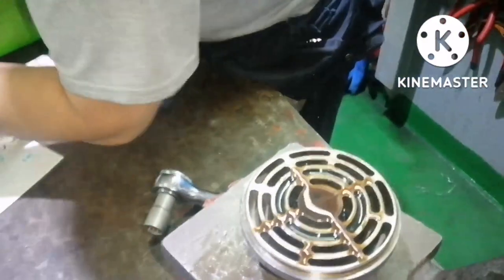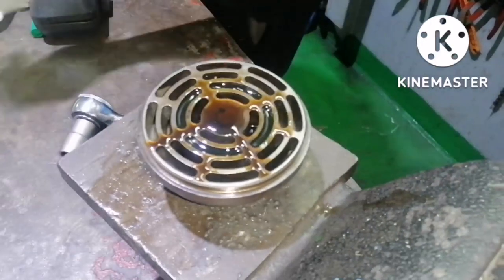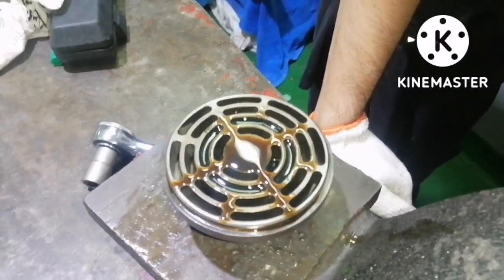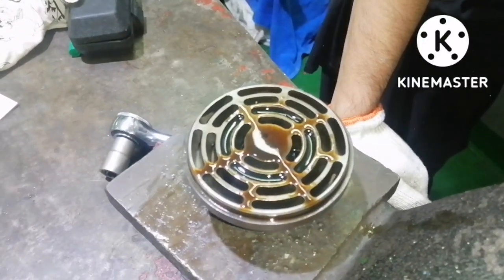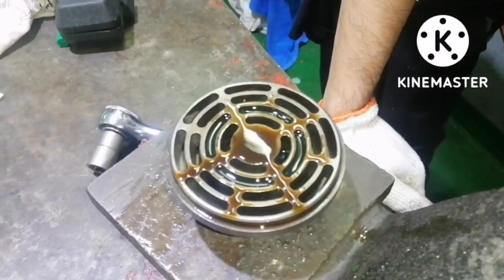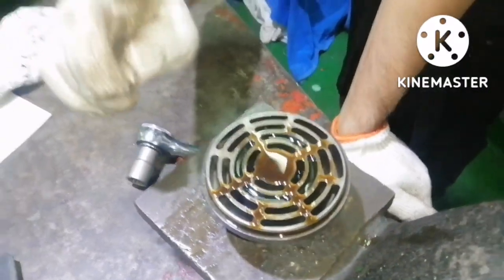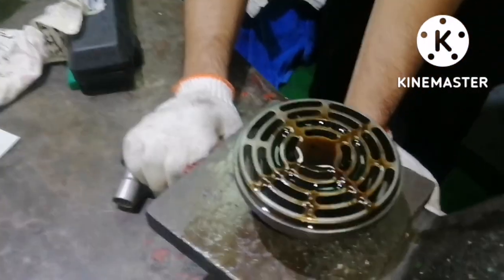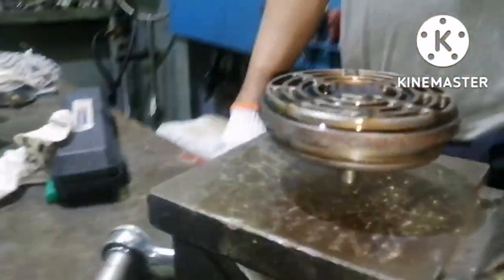You have to see if the diesel oil is sustaining without any leakage from the other side. You can see the diesel oil I poured on top of the valve is still sustaining and it is not getting reduced — that means it is not leaking. I will show the bottom side so you can confirm there is no leakage from the other side.